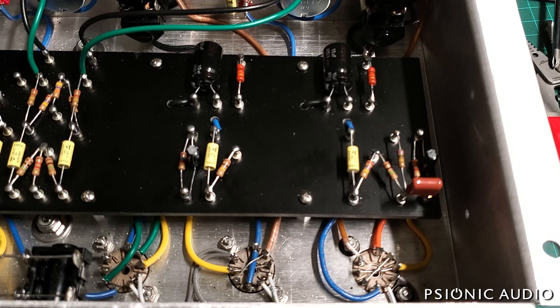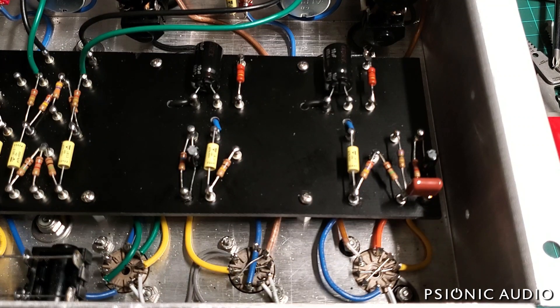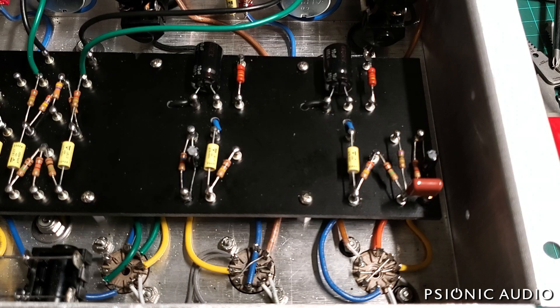The supply voltage has stayed the same. The wall voltage has stayed the same. This is a variation from tube to tube, and it's not quite the same ratio. If I were at 112 and 75 and then like 120 and 80 or 130 and 85, I'd have about the same ratio. But the ratio has changed when I change tubes, and I don't know whether I should go with the Tungsram or whether I need to chase getting the ratio better with the Electroharmonix.